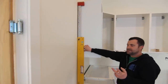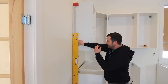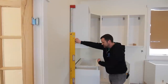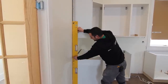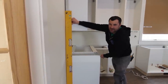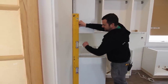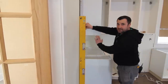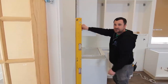There are two ways to do this, depending on how picky you are. If you want to be really precise, you'd oversize the panel — we're using a 36 by 96-inch panel — oversize it by whatever the gap is. Measure from the wall to the face of the cabinet plus three-quarters of an inch, maybe a hair less. Then you'd put the panel in place and scribe it to the wall to contour it for a tight fit. That's the more precision way — takes more time, gives a better result.